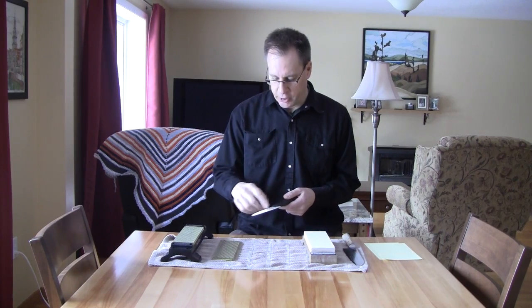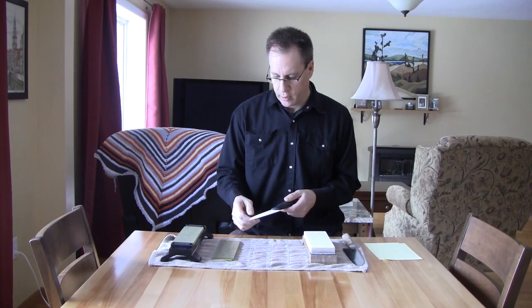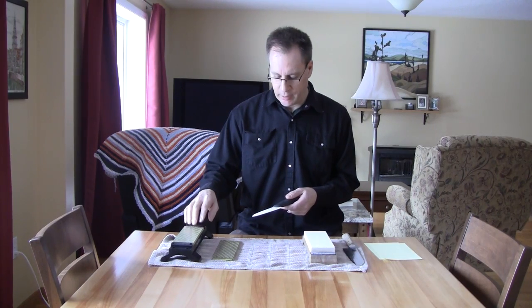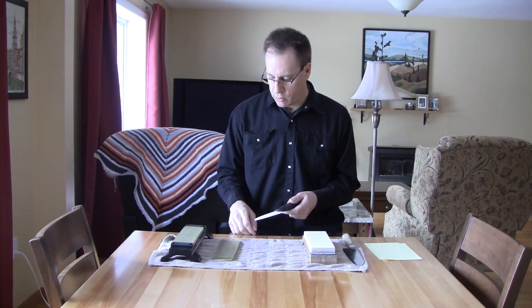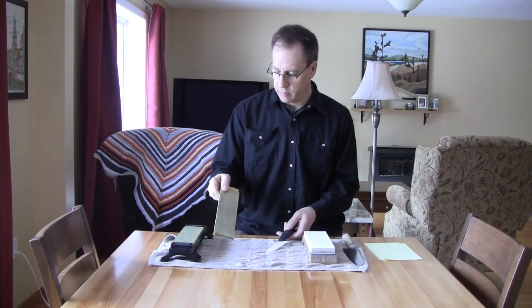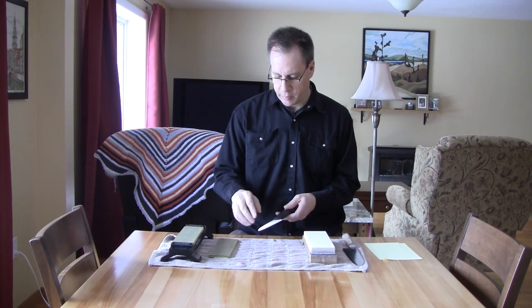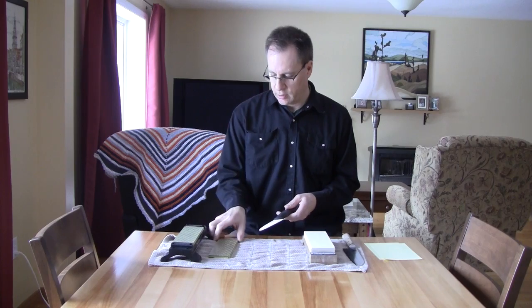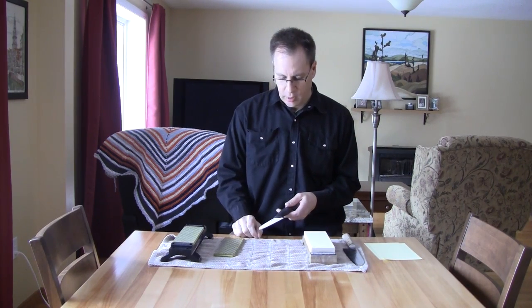And I've noticed that the chips were not disappearing, so I didn't know if it was sharpening or if it was the diamond themselves causing more chips to the blade. So then I switched to my 600 grit diamond, and then the chips started disappearing slowly, but I spent 15 minutes on it and I still had chips.